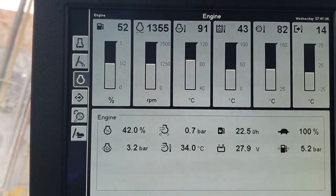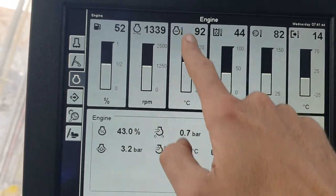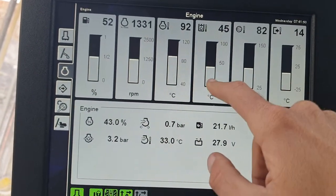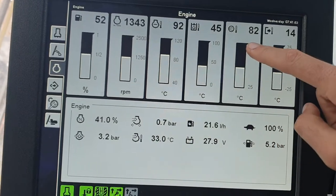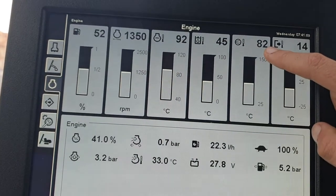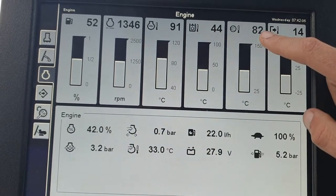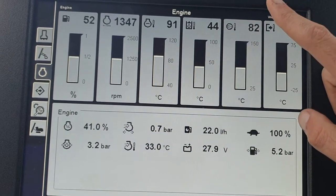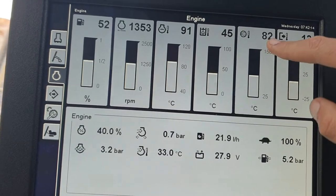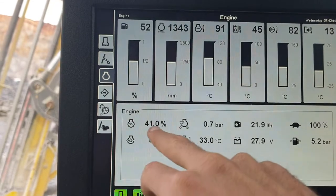This screen tells us temperatures and other readings. If the engine temp gets too high, it'll show up here and we'll get warning lights in the bottom corner saying you're overheating — same for the hydraulics. If the compressor gets too high, I think it throws a high-temp warning at around 100 to 115 degrees. Compressor overheating could mean it's a very hot day, the cooler packs are full of dirt, or the compressor has barely any oil in it — which is not good. We also have engine load as a percentage.